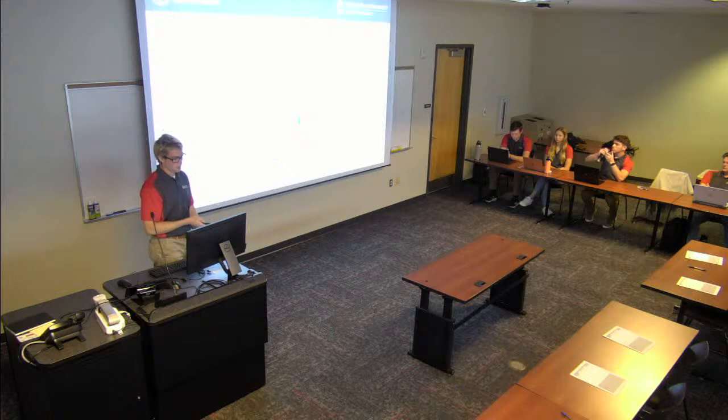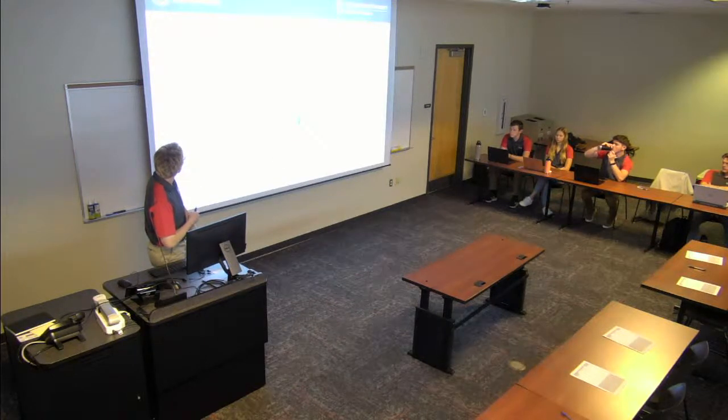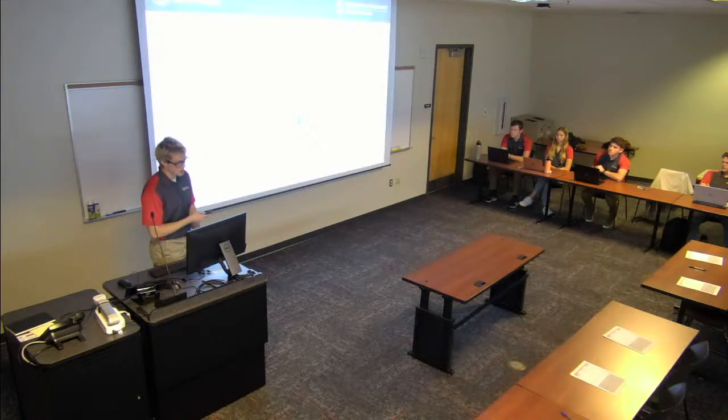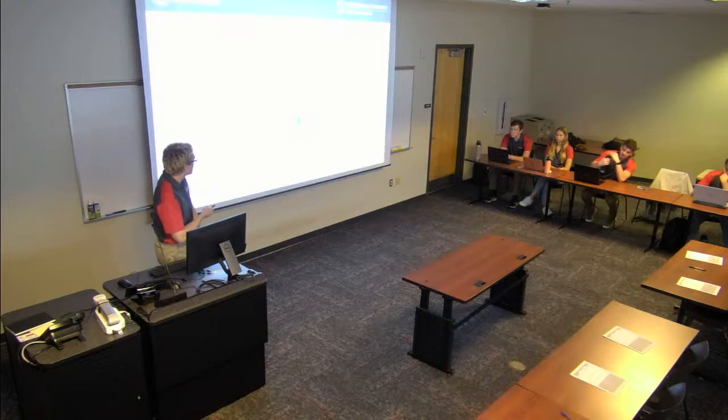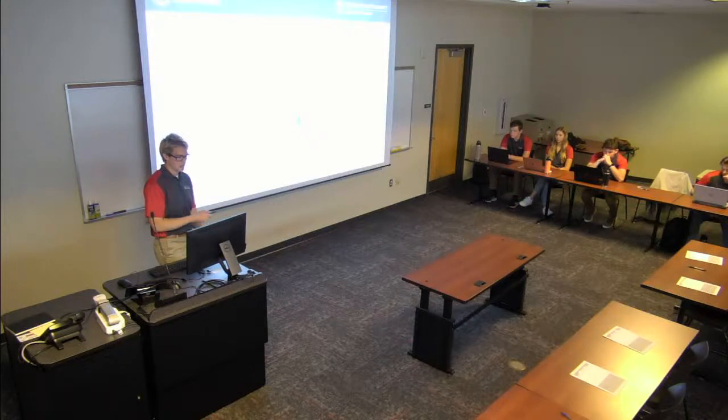And then after we run those simulations, we can pull out results like this drag coefficient residual. You can see where the drag coefficient converges on this graph, and we can use that result to see just the drag coefficient at whatever speed we're testing it at. You can't really see it too well on here, but we can pull out pressure contours as well and see pressure distributions around the rocket. And there's other things we can look at, like temperature, speed, and density.